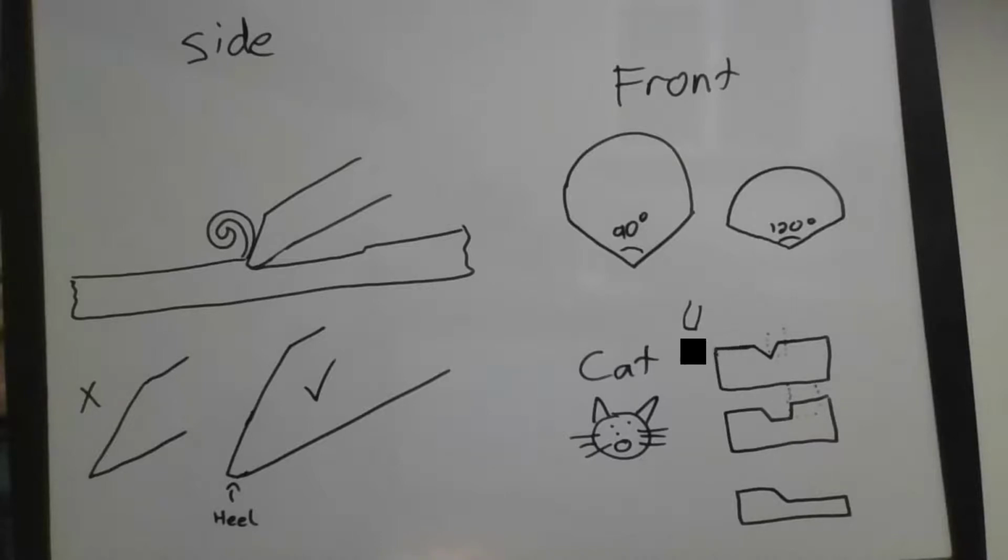What I'm doing is I'm taking a flat graver instead of a V-shaped one. I'm taking a flat one and I'm riding it along this edge right here to create a little groove like this, and this little flat spot right here gives me a safe area away from the wall of my engraving. So then I can come back with a larger flat graver and I can take out more material, and I'm not at risk of hitting the wall of my engraving. What that leaves me with is kind of a recessed background.